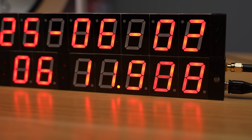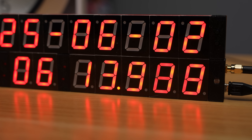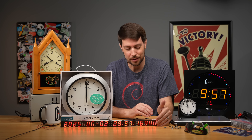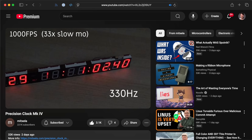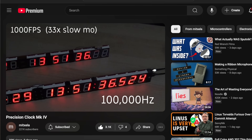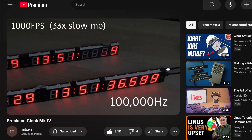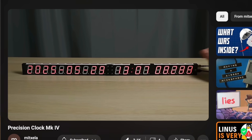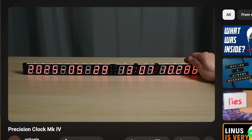You can tell he's put a lot of time into every little design aspect. The coolest thing — and something not that obvious — is that if you've ever done electronics and built displays with seven-segment displays, the way the drivers work is not all digital with PWM for dimming. You might notice if I put my hand over here it dims down a little bit, and if I let go it brightens up. That dimming is analog, not a digital PWM signal, and that lets you do things like — when it dims and you're looking at it on a high-speed camera — these digits will still roll over accurately, so you'll see 1, 2, 3, 4, 5 with no gaps, no flashing.